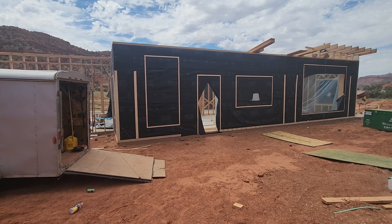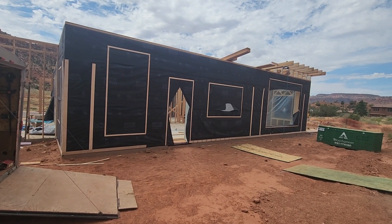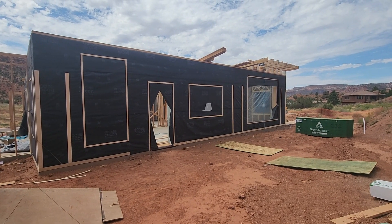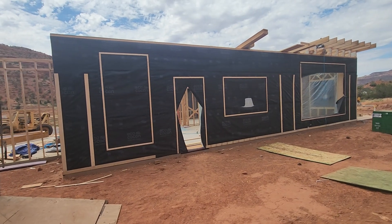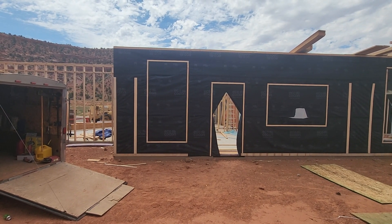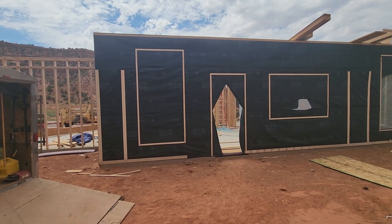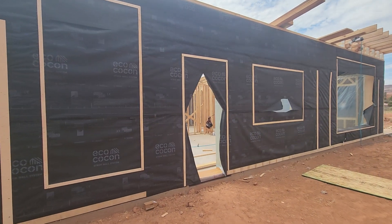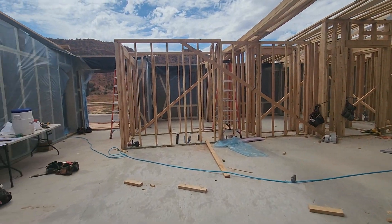The fire rating of this project is actually quite good too, especially with the proper siding material. If you use steel, stucco, or fiber cement board on top of this, the wall panel itself does not hold fire — in fact it's resistant to fire for up to 120 minutes, which it's rated for. So this house will do quite okay in smoke; it'll be airtight with the ventilation system, and when there's a fire you can literally turn off the ventilation system to keep smoke damage from hitting the house itself.